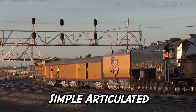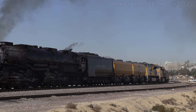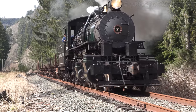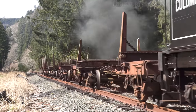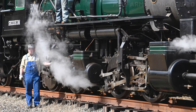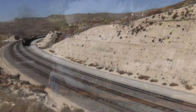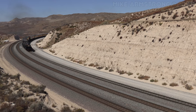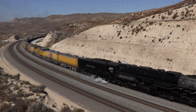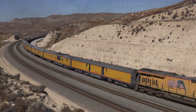In compound articulated Mallet locomotives, the steam is first used in the second set of cylinders on the rear driving wheels, and then in the first set on the front drivers. The front cylinders on a compound articulated locomotive are larger than the second set, so if you see an articulated steam engine and you aren't sure if it is a simple articulated or a compound articulated, this is one easy way to tell. While there were many simple articulated locomotives built using the same Mallet concept of having the rear set of driving wheels attached to the frame with the front set on a separate pivoting frame, these are not technically Mallets because they are not compound locomotives — a key component of Anatole Mallet's design.